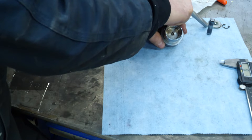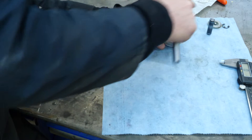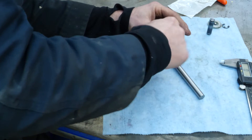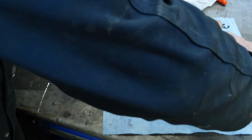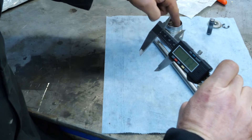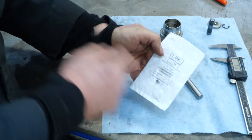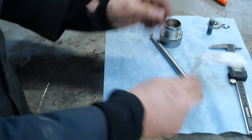I cut away the pinch marks that held the stack of washers and the circlip in place. Now I need to figure out how to retain them when reassembling. The internal diameter of this bore is an imperial size — one and five-sixteenths of an inch. A one and five-sixteenths inch internal retaining ring in stainless is available on McMaster-Carr, so I need to machine a groove for this ring.